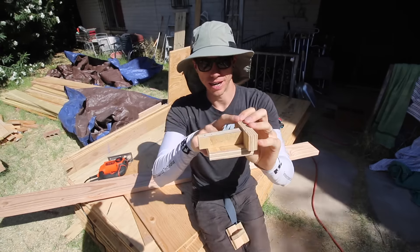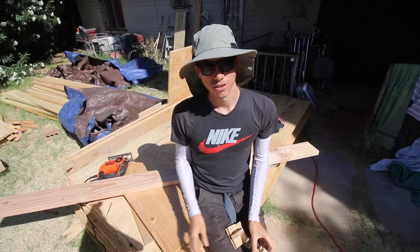These are the little templates or jigs I made so I can draw the cut lines directly on the joist. Then all I'm doing is going around with the jigsaw and cutting right on the line. It's definitely a lot easier and more precise than the circular saw. This is my low-end piece — I just stick it up against the joist, make sure it's nice and tight, and draw the lines all the way around.